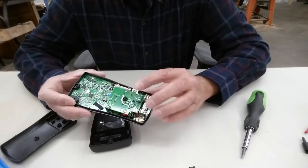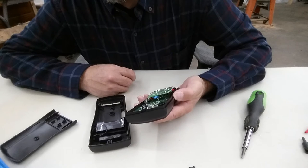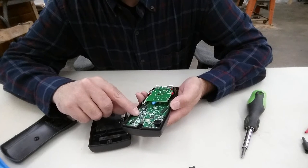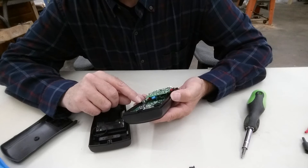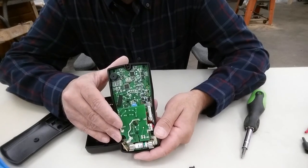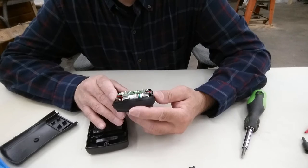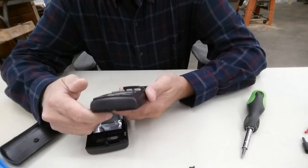You can see they got a little over-soldered on this here. I wish I'd brought my glasses out. A couple of these components — I don't even know what size that is — it's about the size of a 1206 but more square, so maybe a 1210. A couple of those look perfectly straight. The 0402s are looking pretty straight too. The diodes above the fuse look straight. There's a lot of flux residue down by the fuse, of course. I don't see a problem — mine looks good.